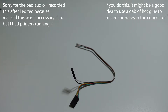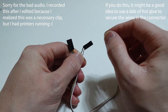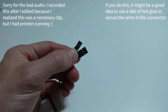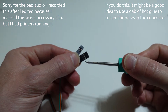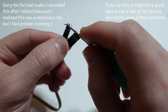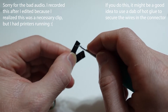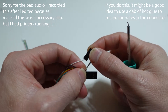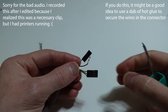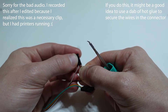If your 3-plus-2 connector pins don't match what I showed, don't worry — all these connectors can be rewired. Flip the connector to the side where you see the individual clips, take a sharp object, pry the retaining flap back, pull the wire out, then reorder the wires so the configuration suits your needs.